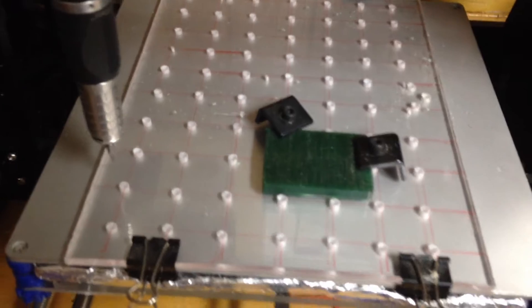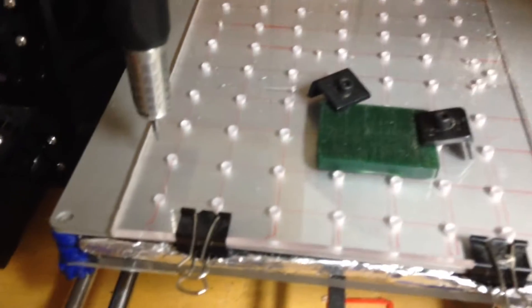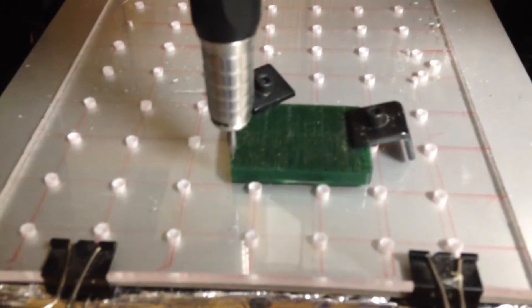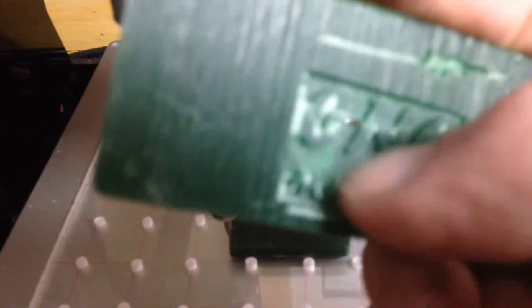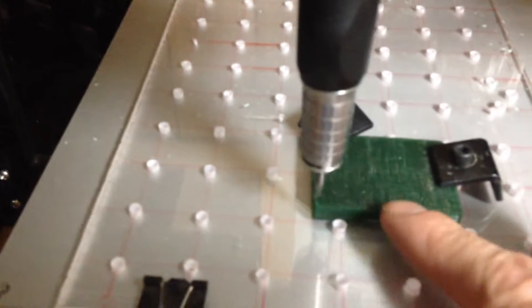The good part about setting up your stock is you can turn on the spindle and do everything while the steppers are disabled, like positioning where you want it. I'm going to go to the corner where I set the G-code to start from. For this file, I set the letters to come up 1.5 millimeters, so I have to make zero at the lower level — not where the letters are embossed, but 1.5 millimeters below that.